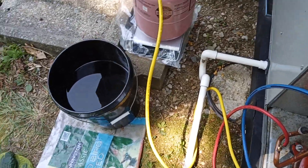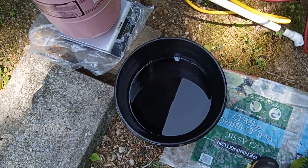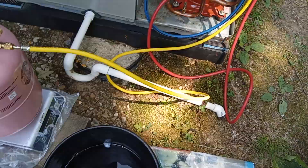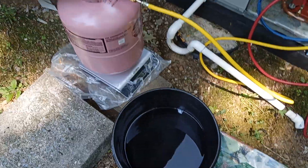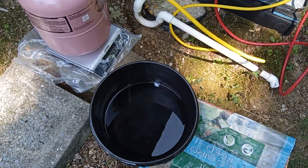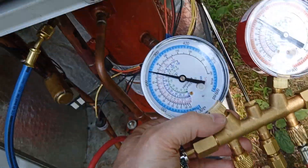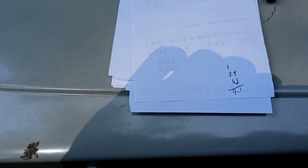This charge slowed down as the tank cooled off — the water cooled off considerably; it was 135 and now I can stick my hand in it, probably a good 115. I immersed the tank up to about the white label for considerably longer. The first time I basically just dipped the bottom of the tank in the water, and doing that raised the pressure up to about 240. This time it transferred 4.1 ounces — much more refrigerant, more quickly — in about three minutes total.